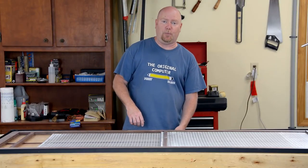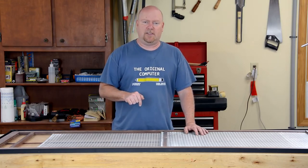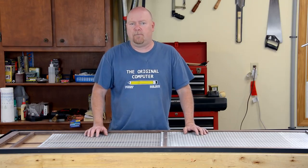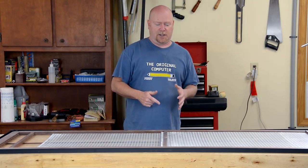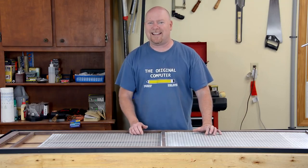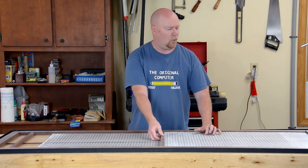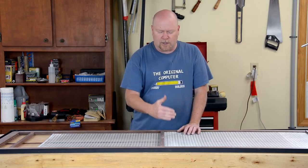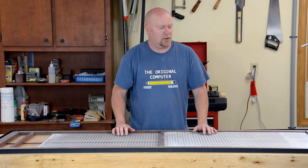I've got the top frame clamped up in my shiny new band clamp here on the bench and I'm fooling around with this expanded aluminum that's going to make the sliding top. What you'll find when you work with something like this is that there's no such thing as the right sized gap for the track — if it is big enough for the aluminum to slide freely, then it is also big enough for the aluminum to rack and get stuck. And obviously if it's too small, it's not going anywhere. The solution to that seems to be sticks. This aluminum wants to sag across a two foot span anyway, so I've cut myself some handles that I'm going to epoxy or screw on from the bottom with some washers. These will stiffen the aluminum, give you something to grab to slide it around, and most importantly keep the aluminum centered in the track so it slides this way but not rack back and forth.